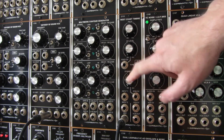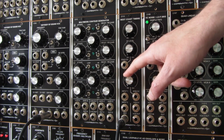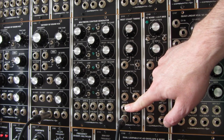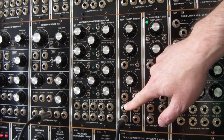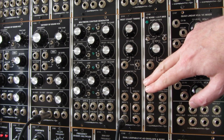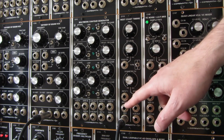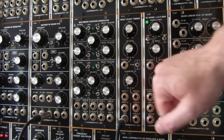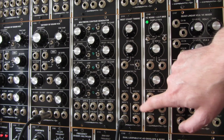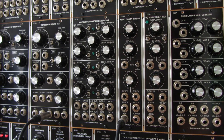This symmetry input also has a CV input. The knob is internally connected to 5V, but you override this connection by connecting a jack to the input. There are two audio inputs: input 1 and input 2. Input 2 has a fixed attenuation of 50% — when you mix two waveforms the signal becomes too complex, so it's better to have the input attenuated. There's also a VCA with a CV control and of course the normal output.